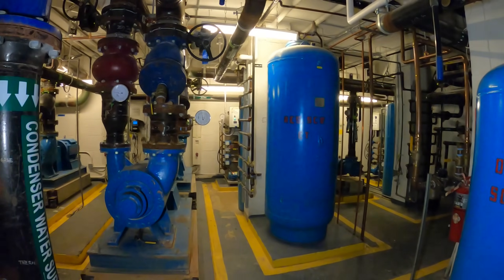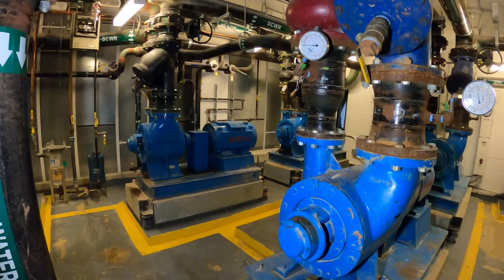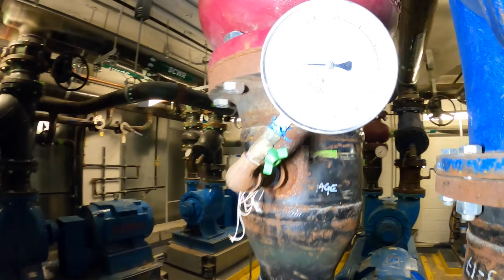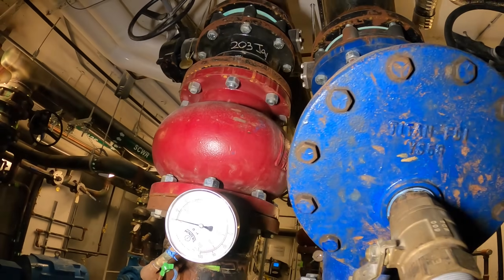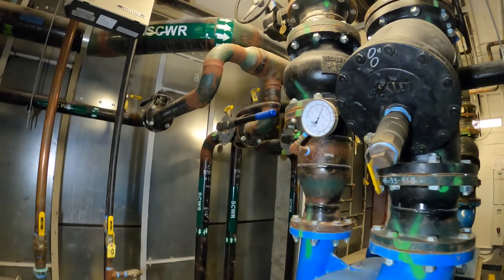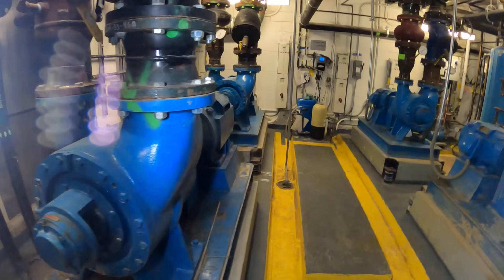They have water source heat pumps here, so they have a cooling tower and these pumps are pumping water throughout all the heat pumps throughout the building. There are parts of the building where a lot of these gauges have either failed — like right here shows zero, it might have failed — or there just might be no water in this setup. Because of that they want to change some water gauges, specifically these. I ordered the same exact ones and we're going to replace all of them — there are 28 in total.